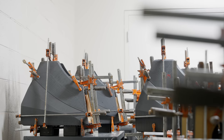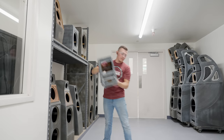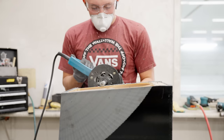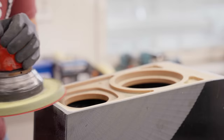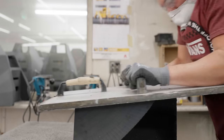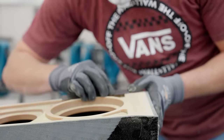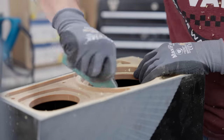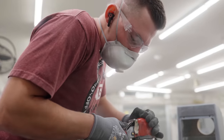After the cure time of the TuneTop — the clamps are removed after five days — Trevin grabs the TuneTop and starts working his magic on the enclosure. He's replicating what is on the standard with this speaker, using a variety of tools and sandpaper: 40 grit, 80 grit, up to 180 grit. He's working to ensure flatness in the right areas, and that the transition points from the front to the side of the enclosure are consistent and smooth so that when the top coat goes on it's a smooth surface. It takes about two hours to prepare one single TuneTop for the next stage.